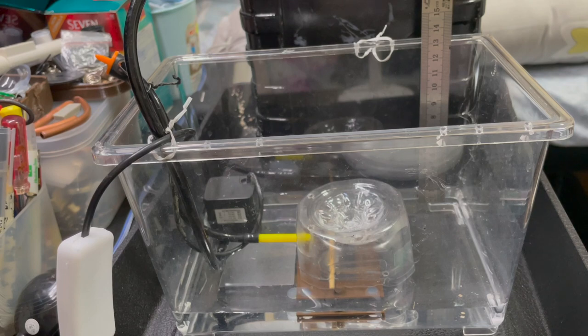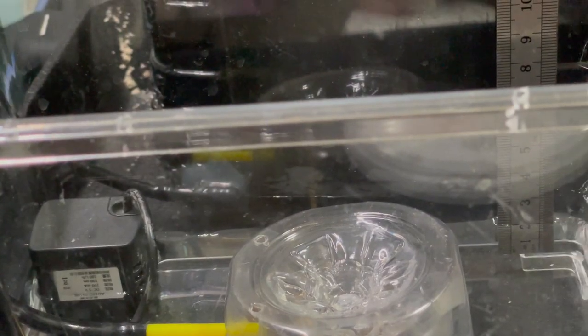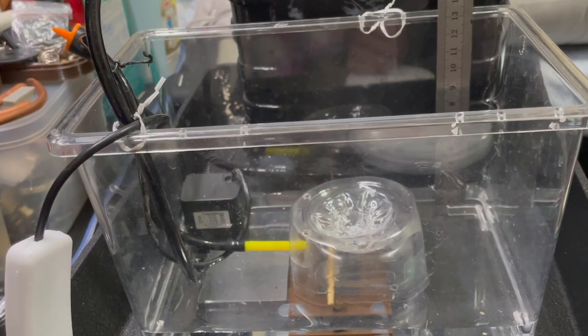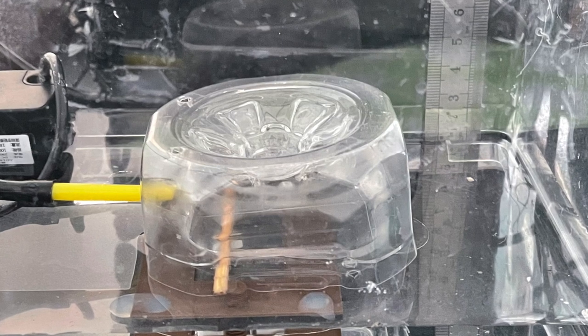the inner flow valve will reach the maximum height, and at the same time, the vertical edge of the flow valve will close the gap between the inlet pipe, the yellow inlet pipe, and the flow valve. And the silicone will be a buffer that will seize the water flow and seal up the inlet pipe.